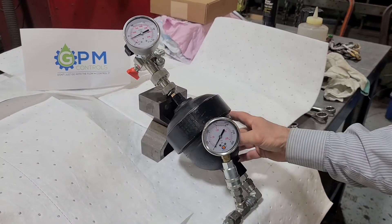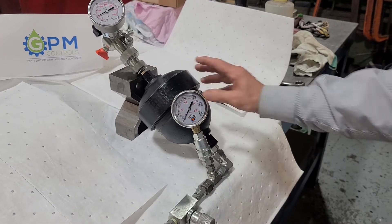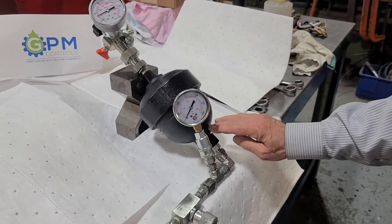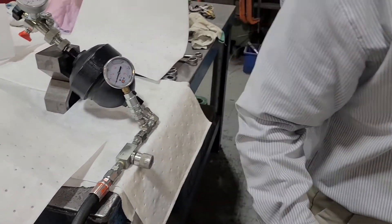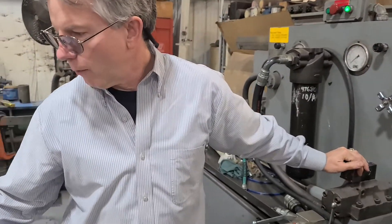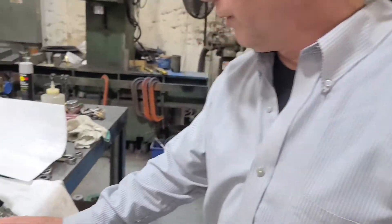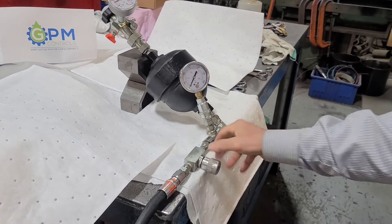At this point, the diaphragm is completely filling up the void inside the shell and there is really virtually zero hydraulic oil in here. What I'm going to do is fire up our test bench, and we will bring pressure to the accumulator, but right now we don't have anything in there until I open this needle valve.